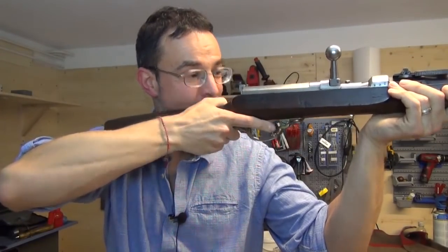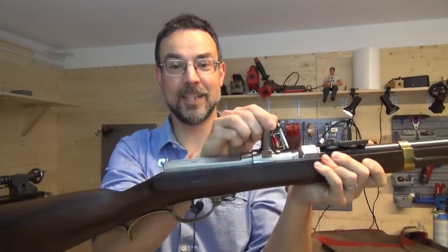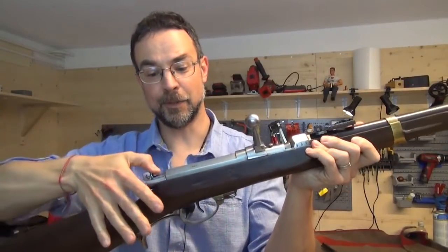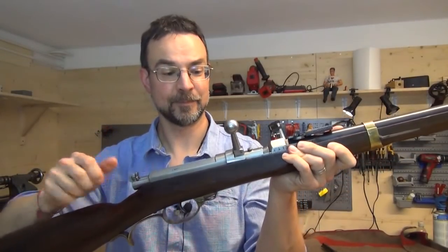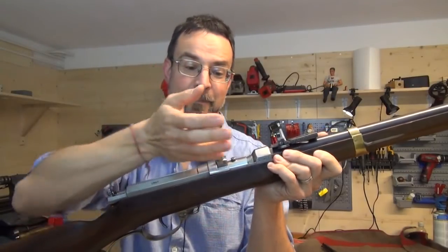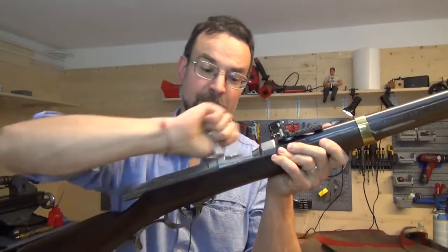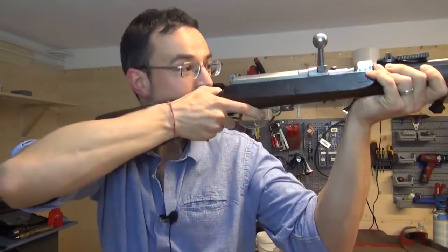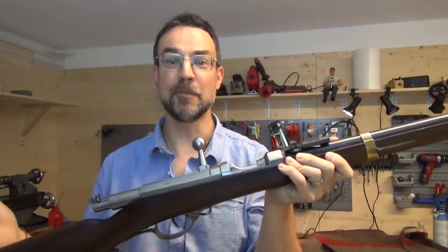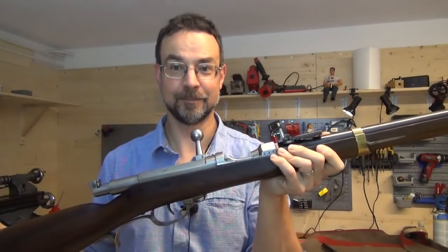If you've fired, you need to release the needle carrier, because it also prevents the bolt from opening. You need to pull that all the way to the rear so that it clicks. That also makes sure that the needle has retracted into the bolt. Then you can open and reload. So close bolt, fire, back, open. So basically four movements. Well, five if you include the loading. Let's see how it does.